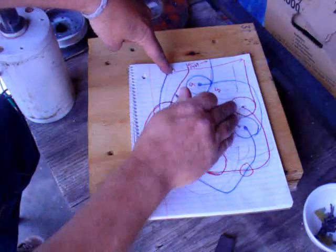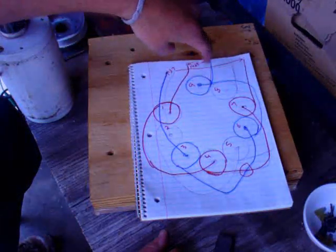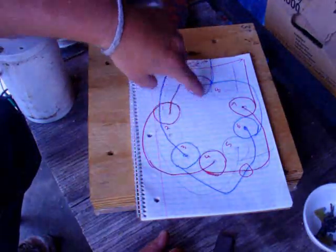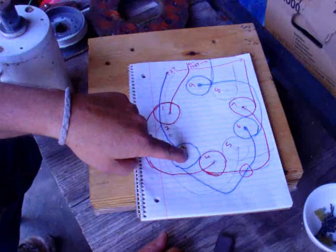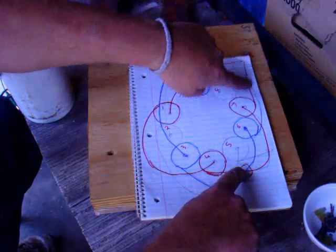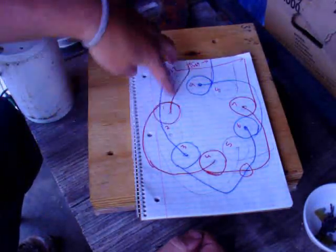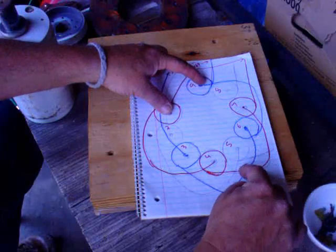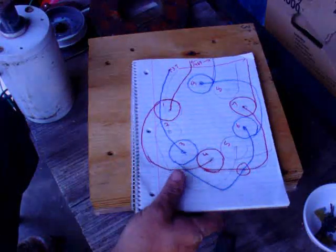Coils 3 and 7 — if I look and I come to the center and then it comes to the outside, and then it comes to the center and comes to the outside, this is the way it goes. And the same thing from here with this phase, it's outside to inside, outside to inside, and outside to inside. I say 3 and 7 — that means this one was conductive and 7 was conductive. And the only two wires that crossed, making it where only two wires were in the junction, were right here. So I decided to test my theory this way, and it came down here — 1, 4, 6, and 9 — these four coils. The one thing that made these two and these two possible was this little connection here. So I searched for it, and I found it.